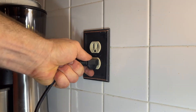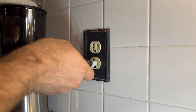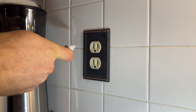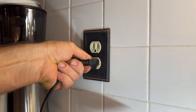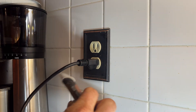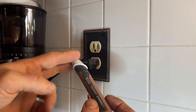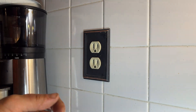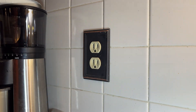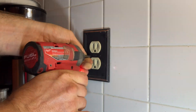We're going to replace an outlet. Always check for power first, make sure everything's dead. This is a non-contact tester — just got a plastic tip on it. I like to plug a power cord of some sort in and check to see if I get any kind of reading. If you get a reading, this will light up and the thing will make a little bit of a beeping noise. I'm already confident there's no power there. I've checked it, made sure the breaker is dead, and we'll go ahead and get this faceplate off.